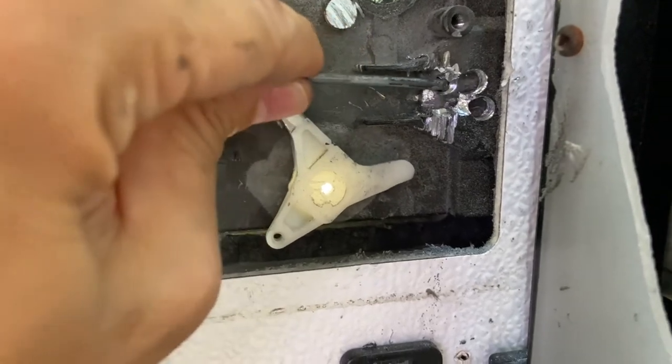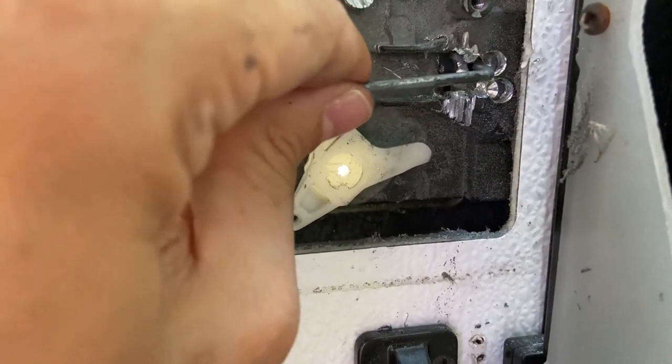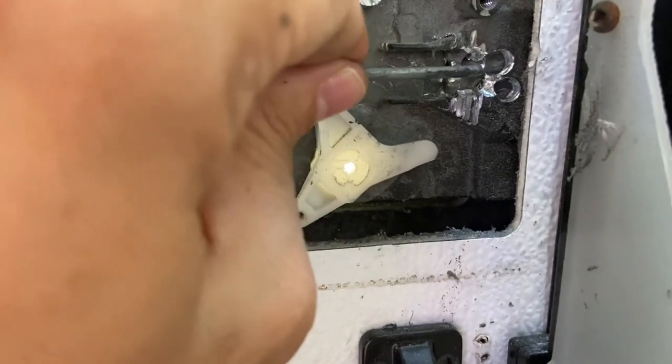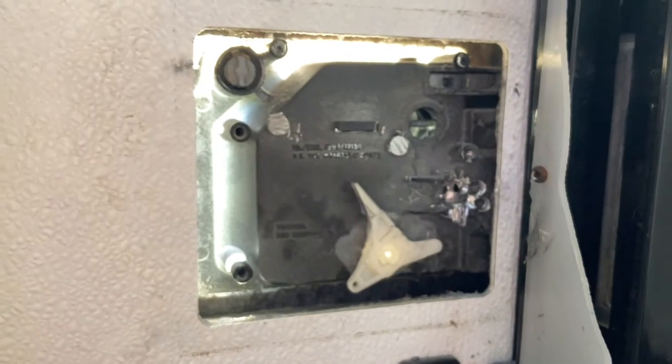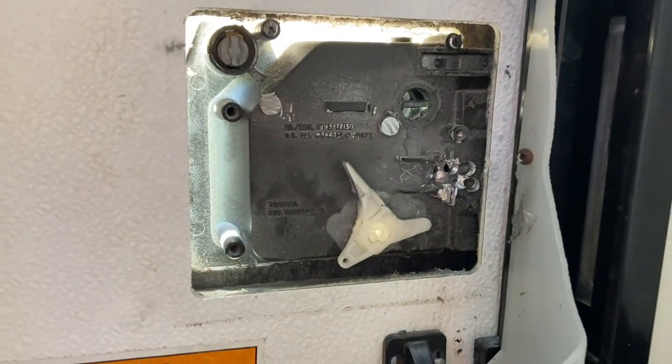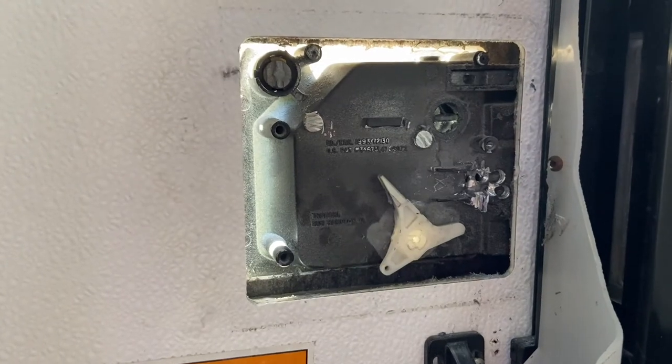This part actually wasn't that hard at all. I used a smaller drill bit to make the hole so I could grab it. If you're in the same situation you're going to destroy the piece getting it off — I couldn't see any other way. The deadbolt was bad anyway, so if you need a nuclear option to get one of these off, that's how I did it: a standard drill with a metal bit to open it up enough to reach in.